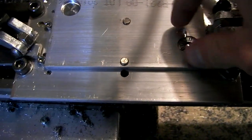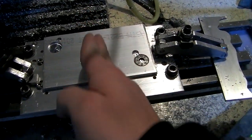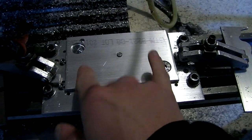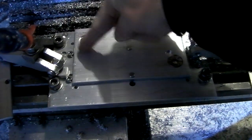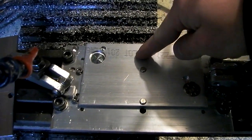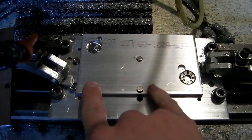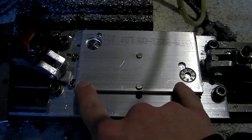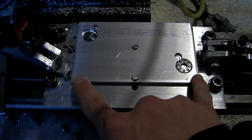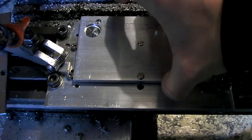They fit now because I moved the plate over. Notice they're exactly on the center line of the part, so that I can flip it over — the center line is always going to be the same. So if this part is exactly 5 inches or 5.5, it doesn't matter, because my reference point is from here to here. If my programming knows that it's going to flip the part exactly on the center line, then this can be pretty much any length as long as it still fits. They shear this on the machine, so I ask for 5 inch but I get 5.3 or 5.1 — it's never totally consistent. But with this dowel pin flippy system, it's going to work really well.